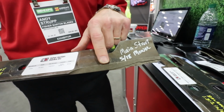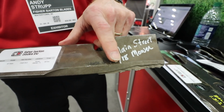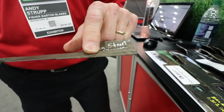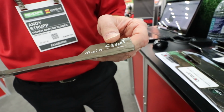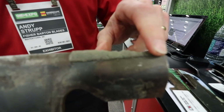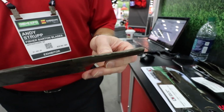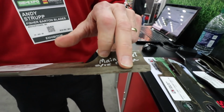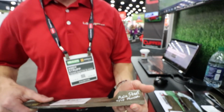What you can see, and it can be a little confusing because people will look at this and go, is this an expired blade? Is it done? But what you see right there is actually the LaserEdge coating that is starting to stick out, and it is forming the new cutting edge. On the bottom side, we've put that protective coating on there, which is called the LaserEdge EverSharp coating. The EverSharp coating wears at a differential rate to the base blade and forms the new cutting edge. Interesting.